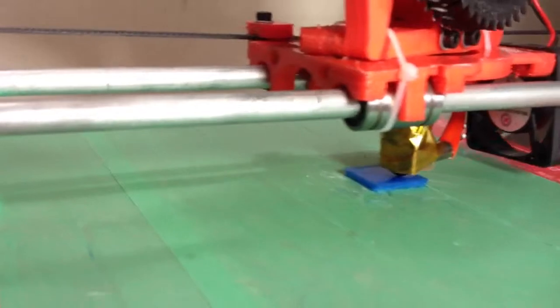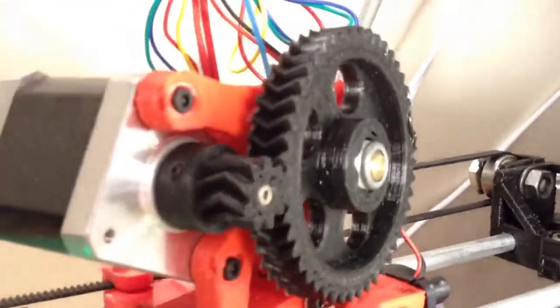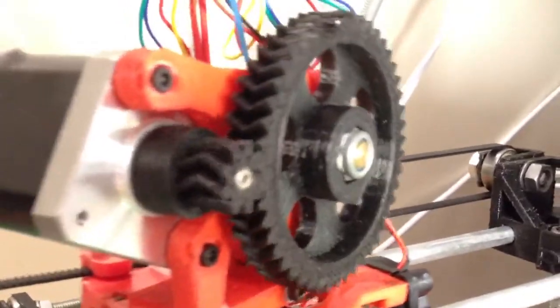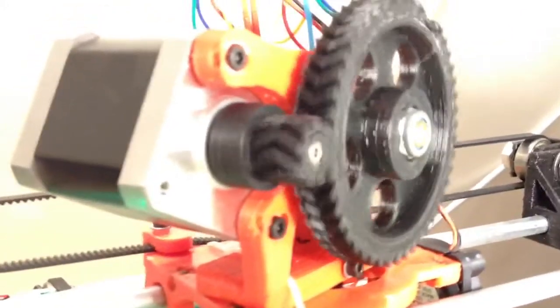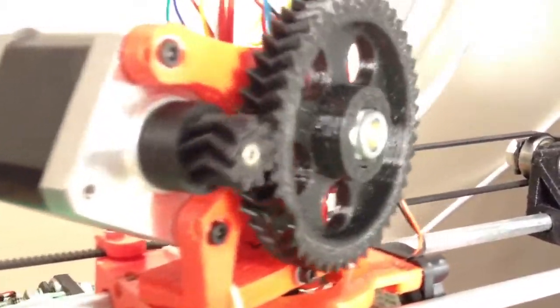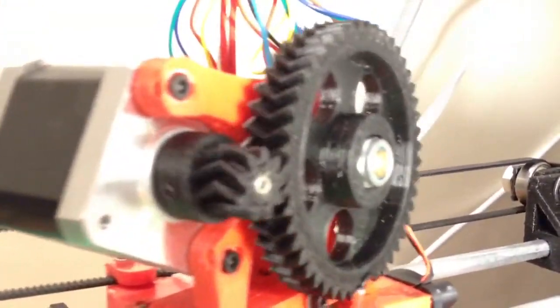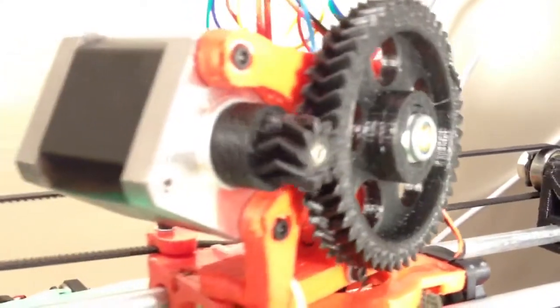Just imagine this replacing my cog. You see that little dented part? While installing the pieces I had trouble with some of the holes which were misaligned when printed. So I got the brilliant idea of using a soldering iron to open up the plastic — you know, melt open the hole — sure beats filing down the holes. But I was being a little careless and I touched the gear with my soldering iron, and yeah, that happened.